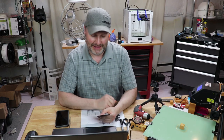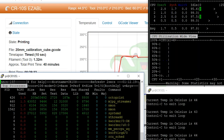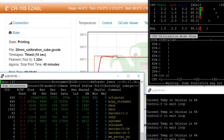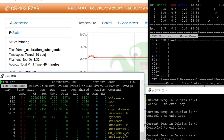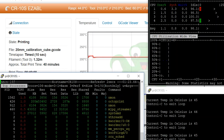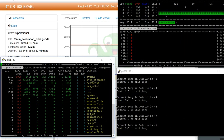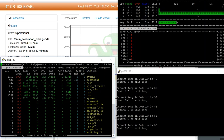We have results from all three tests. Let me give you a little screenshot and time lapse of each of them. First, let's cover the bare board. As it's trucking along, you're seeing the temperature bounce between 43 and 44 degrees Celsius. Then as we get to the end where it does the AV convert — where it takes that stream and turns it into a file — you're going to see that spike. The temperature rises and we hit a high of 53 degrees Celsius.